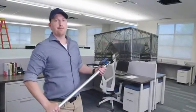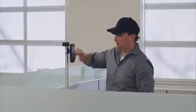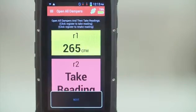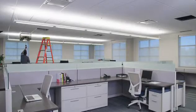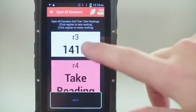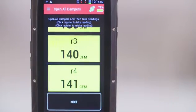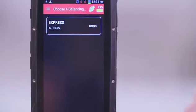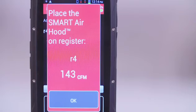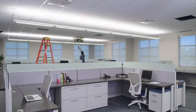All the information is now entered and we can begin the balancing process. Begin by opening all the dampers to provide 100% airflow, then make a full system sweep to get the total flow of the branch from all of the registers. To ensure accurate readings, you must select the register, then press again to lock in the initial reading. By selecting this twice, you help to eliminate false readings. We have finished our initial sweep of all the registers in this system. The initial readings have been recorded and entered into the PredictAir application. The application will give you prompts to balance the entire system in the most efficient way possible. Internally, it does this by calculating the constant flow resistance in the system and predicting how each damper adjustment will affect the entire system.